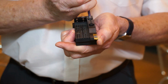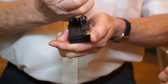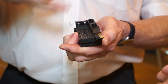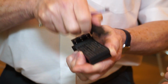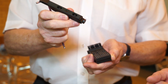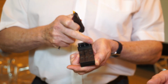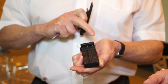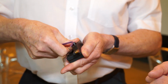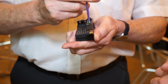Okay, fine. Well, the tool holder is secured with these captive screws through the shank, so they can't fall off and go in the swarf, so it's very, very easy. You take it off, you have the screw in the back there, which is the register screw, and in the holder there's a register plate and there's a spring loaded ball that pushes it against it, so when it comes out and goes back in, it goes into exactly the same position and you secure it, and that's it.